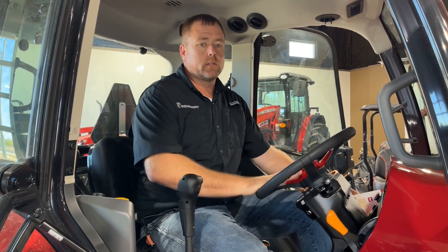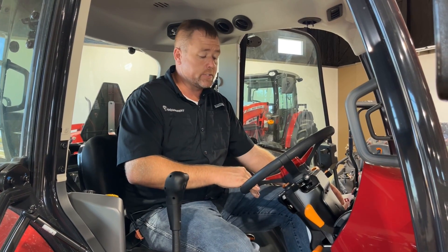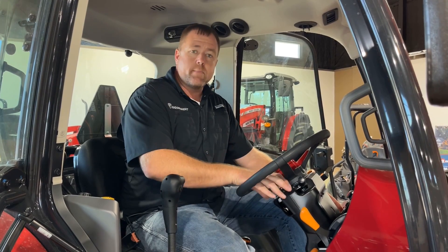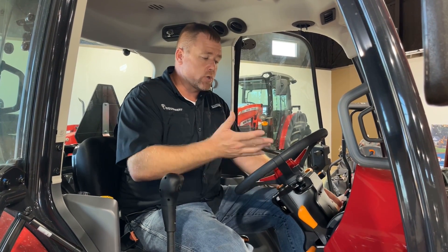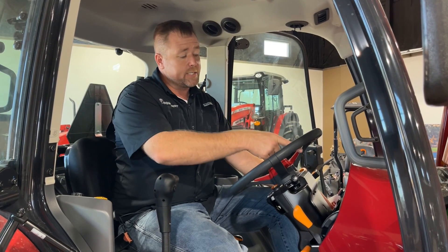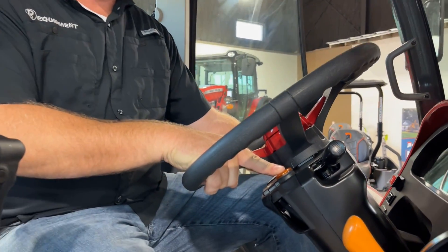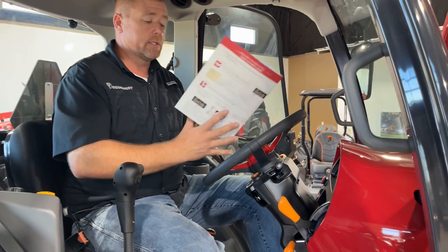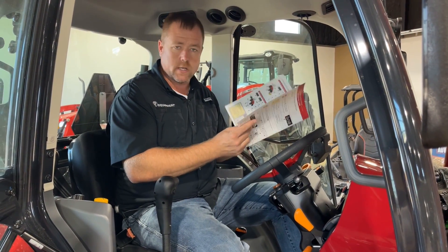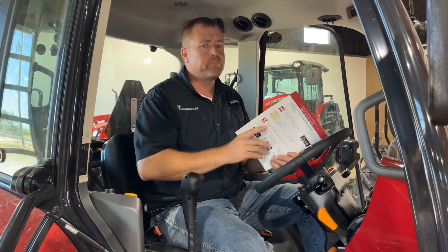I wanted to jump up in the cab and talk a little bit about what this looks like inside the cab. Most all of these tractors — and I know for a fact the Massey Ferguson and the Yanmar tractors that we sell that utilize the regen system — have some controls basically right beside the steering wheel. In the Yanmar tractor, this is a system that requires you to start the regen. When it's time for a regen, it's going to display on the dash with a light telling you it's time to regen — it's going to blink and beep at you. It's going to display the message: press and hold the regen switch for three seconds. Here's the regen switch — you push that for three seconds and it's going to start that regen. If you just hop up in your tractor cold, it's not going to let you start a regen, but once you get it warmed up, it's going to be time to start a regen.